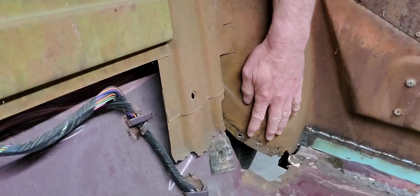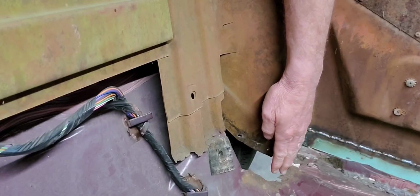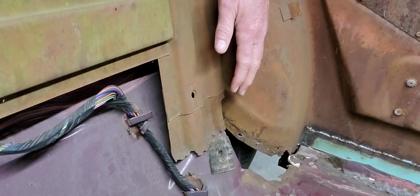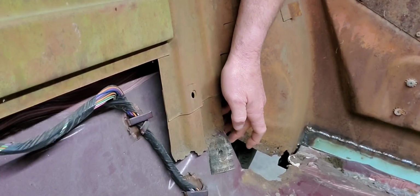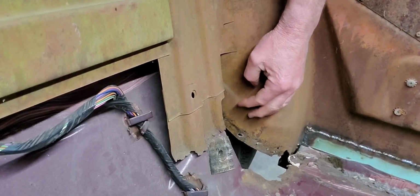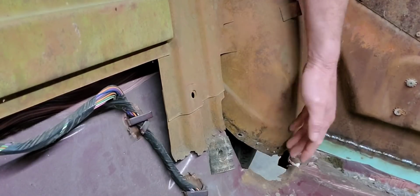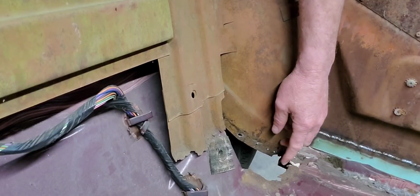Well, right here is that little area where, like I said, it's kind of squared off more on the Roadmaster chassis, and then it's kind of rounded on the 57 wheel tub. The rest of it back up in there actually just literally fit perfect right over the Buick Roadmaster floor and the 57 Chevy wheel tub area. So this is the worst spot on the front side of it, but it was actually a little rusty here anyways, where some salt and stuff apparently had kicked up and kind of rotted the Roadmaster floor up.